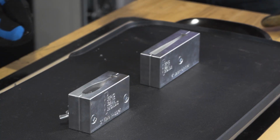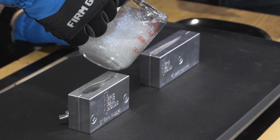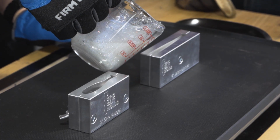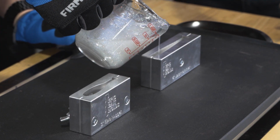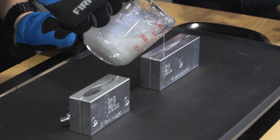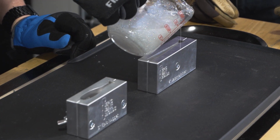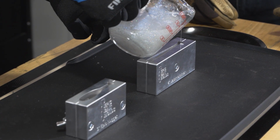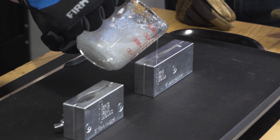All right, so he's gonna pour the 4-inch jackhammer, and you wanna start on the fattest or thickest part of the body. That way you have more room for actually pouring. And since the mold is hot, this is gonna flow naturally all the way back. And on tails like this, the paddle tail is small. You actually want that plastisol to kind of flow down into the paddle. You don't actually wanna pour directly on it, because it will kind of block that off, and you won't get a complete tail.